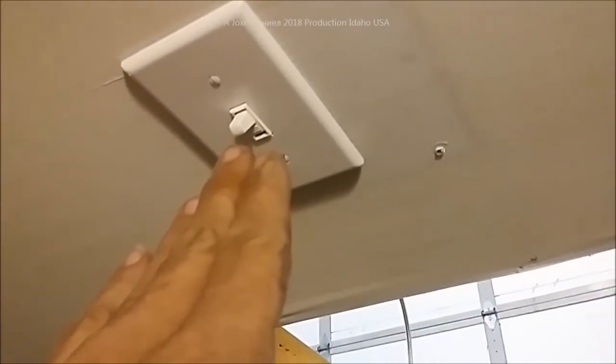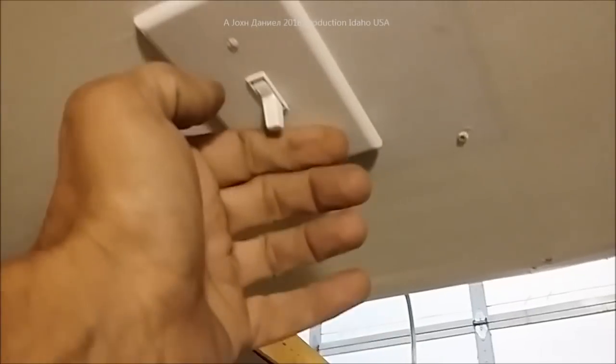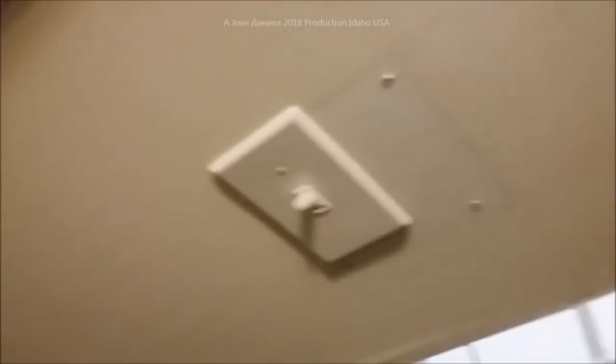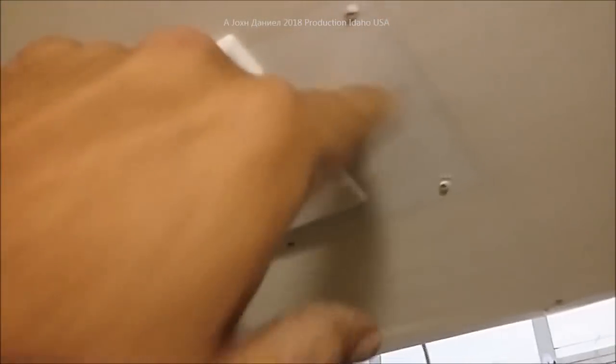And right up here, don't freak out. I don't need to hear it from the electrician superior people. That's gonna turn on 1/2 of an amp of DC LEDs in here. So you're talking 7 watts, big deal. Works great. That's where a light fixture was. You can see the outline of it. And we're gonna patch these with a little bit of stuff and make that go away.